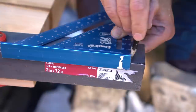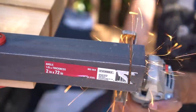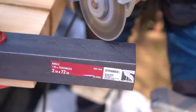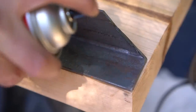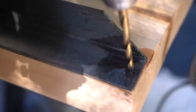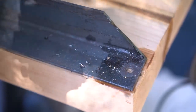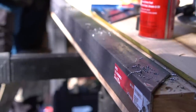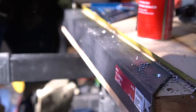For our bracket system, we're going with eighth-inch thick L-metal — an extremely strong, durable steel that gives us a tremendous amount of strength. I cut it to length with my angle grinder and a metal cutting blade. I mark a 45-degree angle on both sides and cut off one tab on each side because we're going to have mitered corners between the back bracket and the side brackets. On the side attached to the wall, I drill half-inch holes at every stud location. On the lower area holding up the shelf, I drill quarter-inch holes on the ends and every other foot. I then use a countersink drill bit designed for metal to properly recess those holes so screws lay flush.